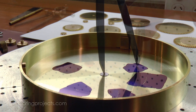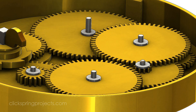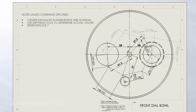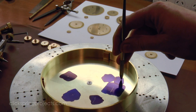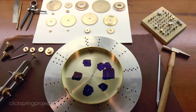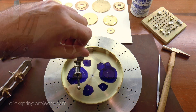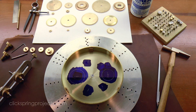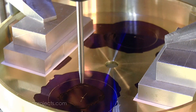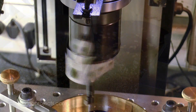The data for this part of the build can be found in the two drawings that you've seen developing on screen. One provides the essential numbers in a quite readable form, and the other provides more context, albeit with a bit more clutter. Now ideally a single drawing would do the job, but I found it useful to have both, and I regularly switched between the two throughout this part of the build. I also found it helpful to put in extra markings, like for example the circles identifying the openings for the zodiac assemblies. These holes are bearing surfaces and will need to be opened up to precise measured diameters, so strictly speaking marking out isn't required. But at this point of the build there aren't that many features on this part to help maintain situational awareness, so the extra markings certainly help to avoid mistakes.